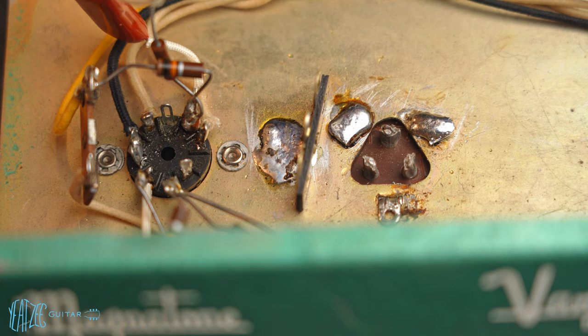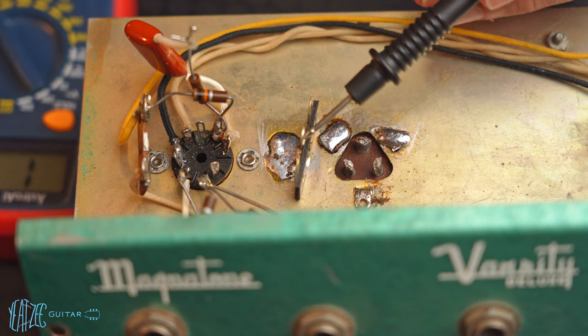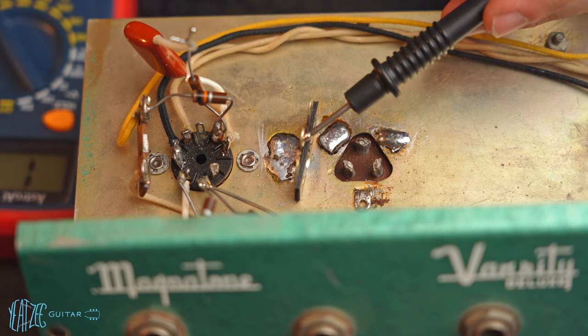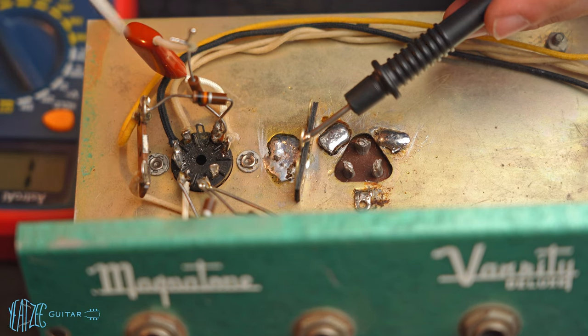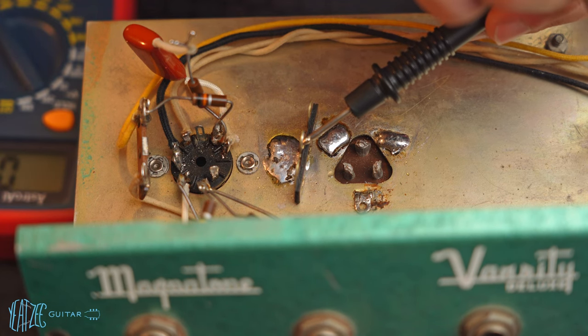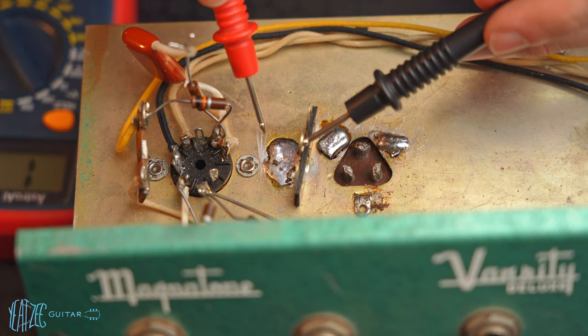So we're gonna go ahead and connect everything to it, assuming that worked properly. And yeah, I think it'll be good. Now, before I connect anything to it, I figure I'll just use the continuity tester on my multimeter here to see if it worked. So we want this to beep if I touch the chassis, which it does. I'm gonna touch some other grounds. So we'll go ahead and touch something over here. Okay, so it seems like it's a good ground.